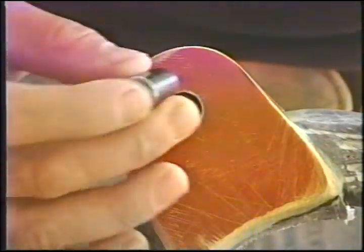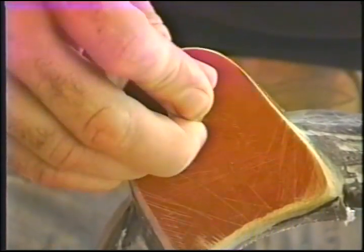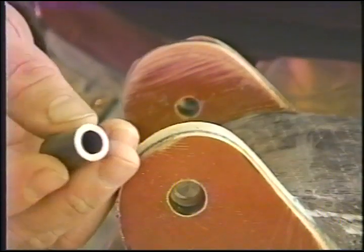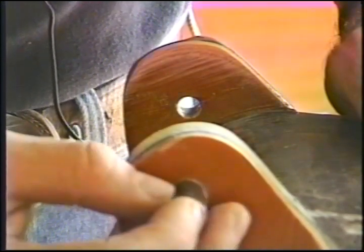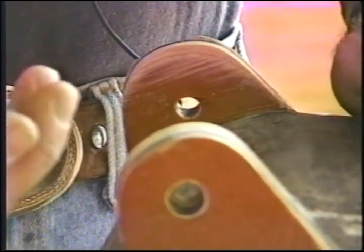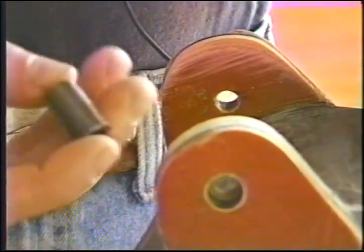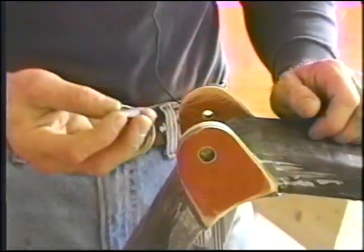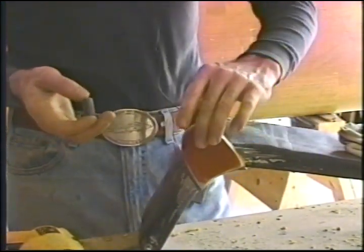This is the bushing here. To say the very least, it's a very tight fit. And with this being as tight as it is, we'll end up sanding the perimeter and cleaning it up, and probably using the bearing potting compound that Loctite makes. And it's not dependent so much on anything other than the close fit, so the press would be more than sufficient, but the potting compound does an excellent job of bonding in place and taking up any other irregularities that you'll find in a fibrous material.